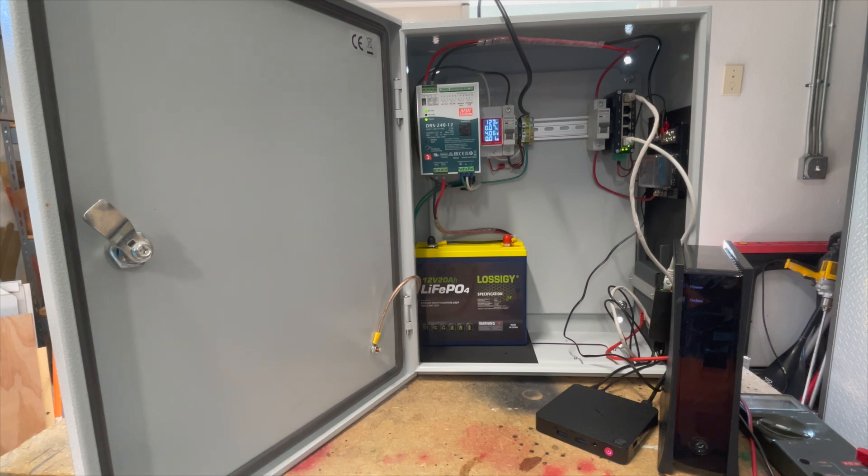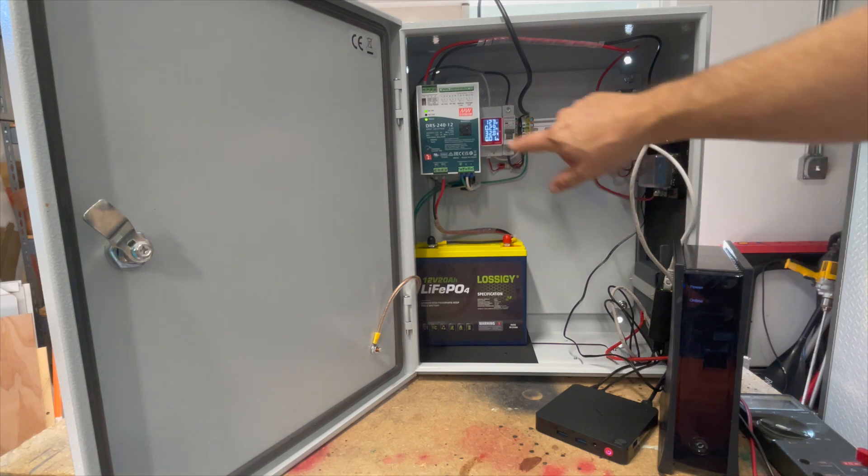This is a really cool product for scenarios where you want continuous voltage and don't want to cobble something together or try to fit a legacy UPS inside an enclosure. If you've done these kinds of projects, you know that real estate inside the can is very valuable. Since you're going to have batteries for a UPS system no matter what, the total volume of the MeanWell supply plus battery is much less than a traditional UPS paired with a separate 12-volt DIN power supply.